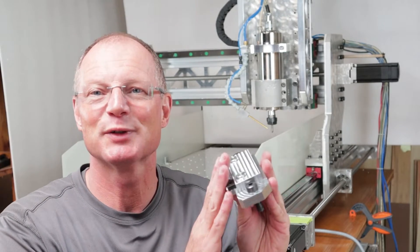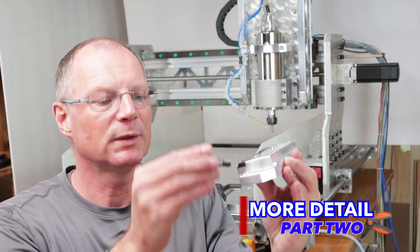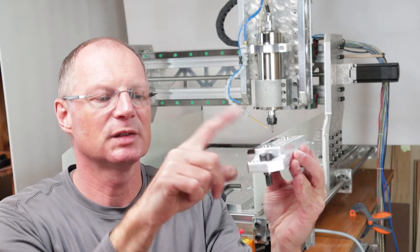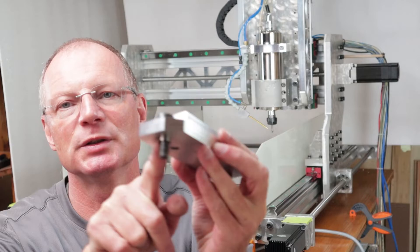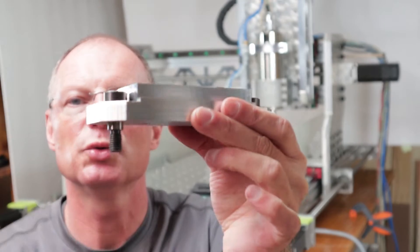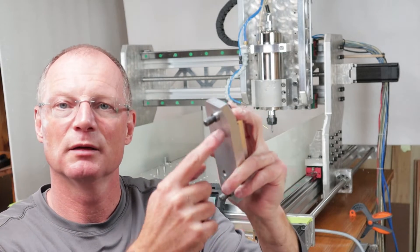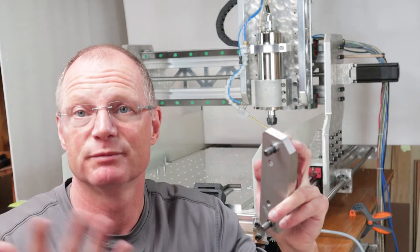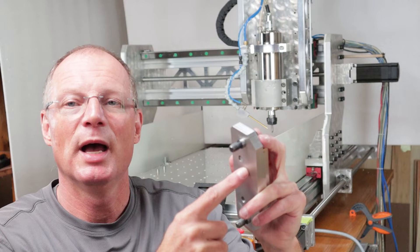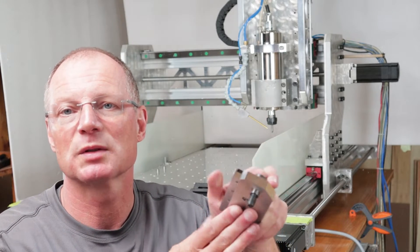Okay, let's spend 10 seconds for the design. To locate this, we're going to use a shoulder bolt. The shoulder bolt has a tight tolerance that is in the lower plate, but then it comes out the bottom, and that bottom section will engage into the fixture plate. Therefore, we do not need to machine a locating feature out of the whole plate, making the plate thicker than when you purchase it than it really needs to be. Nor do we need to press in a diamond-shaped locating pin or something like that.